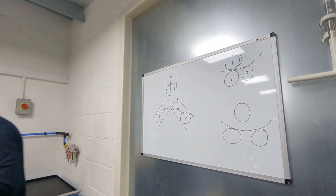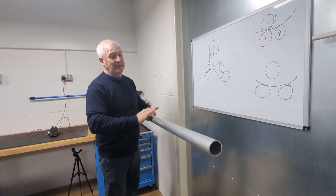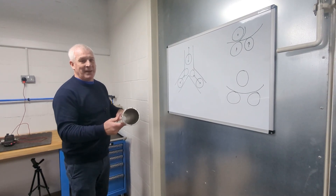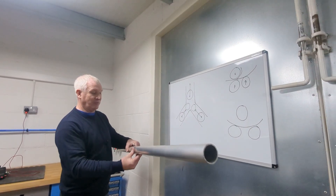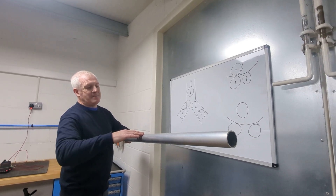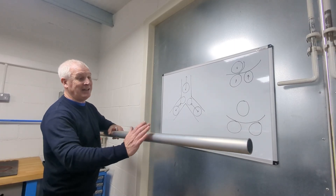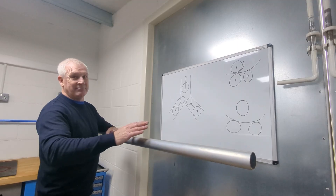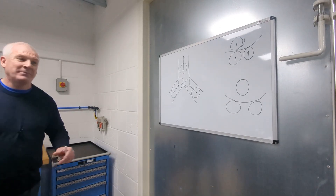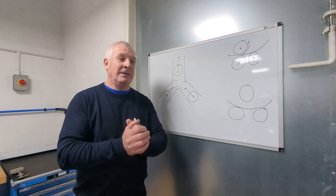The rollers — that's the sort of diameter I'm after — will bend, but they bend back into shape. If you put material there it will roll it fine and then just pop back. To stop that bending, I want to put carriages — what I call carriages — at intervals along the roller, on wheels so they roll freely. And if they're adjustable, if the material starts to canoe, you can push that up and bend them basically the other way so the material actually comes good. Now that's the theory anyway. I didn't want to waste time making this machine, but I don't think I've got any choice. If you see this video on YouTube, chances are I've made it.